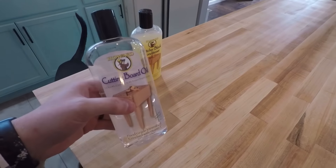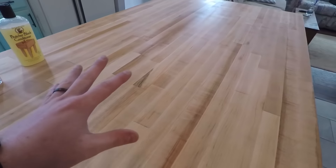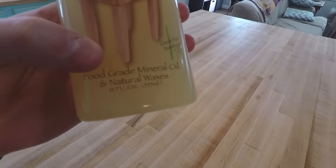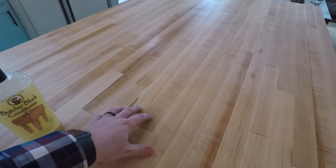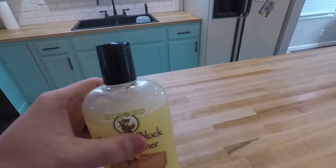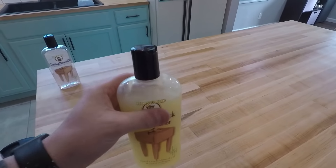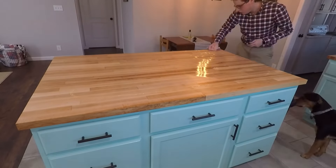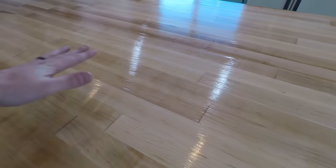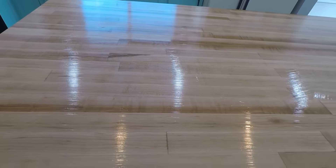I've put five coats of cutting board oil on the countertop and let each soak in for at least a few hours, then wiped off the excess. Now I'm going to start using the conditioner — it has the same oil in it but also includes wax, and that'll help keep water from absorbing into the countertop. You see how it's kind of liquid? It's normally a solid, but I ran it under hot water for five or ten minutes. You've got to warm it up and then put it on just like the oil. I've got that on there — it's kind of like a gel and does somewhat absorb into the wood. Basically it will dry like wax on your car: it'll get hazy and then you buff it out. I'll do that a third time as well and then we'll be good to go.